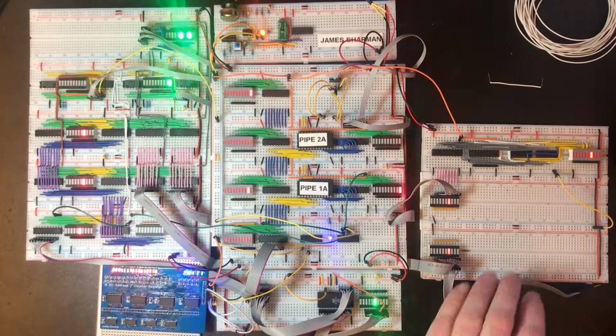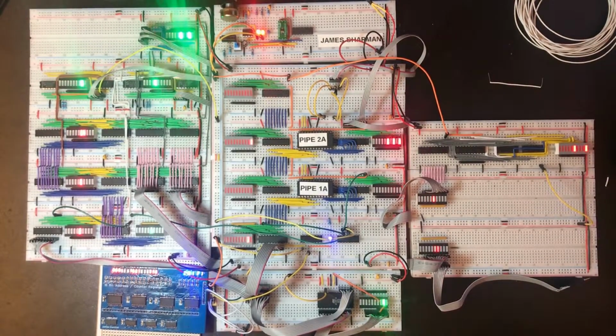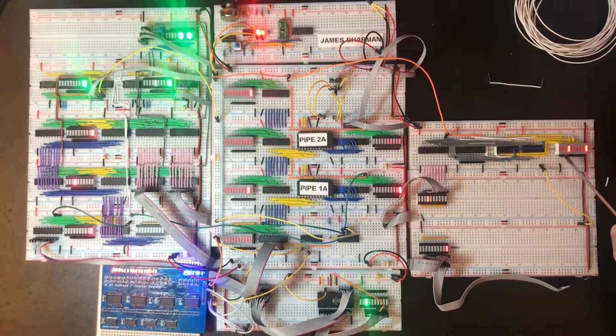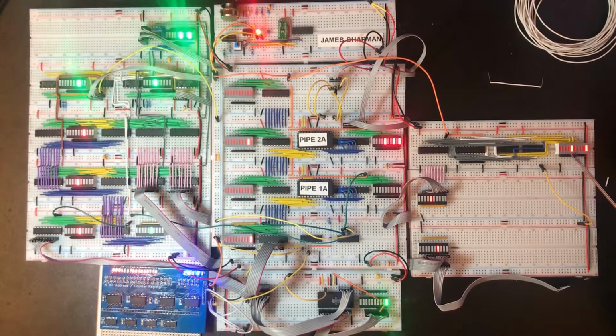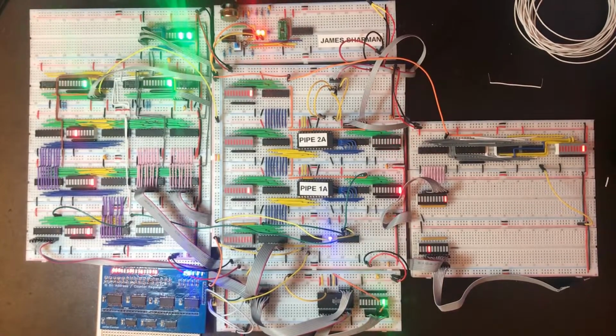Let's have a play and see if we can understand what's going on. So if I set the carry bit, then this is interesting. This number is just running through the powers of 2 to make it bounce backwards and forwards. It's the input we've got here. When that is 1, we're adding 1 to it. So when that gets down to there, the result is 2. So just this LED comes on during the bounce. So that's working correctly.